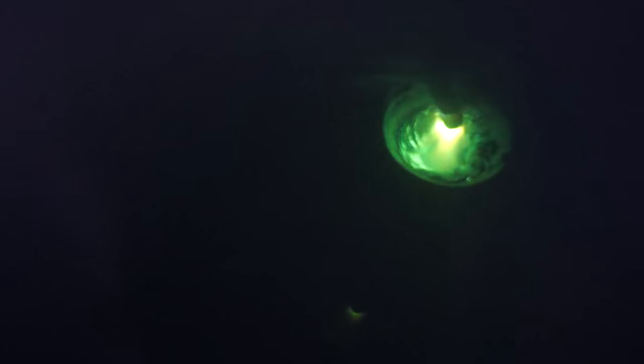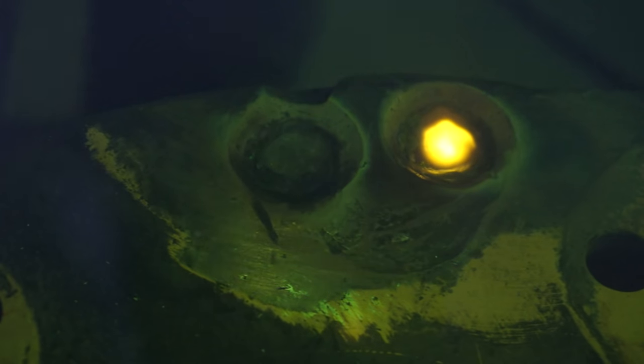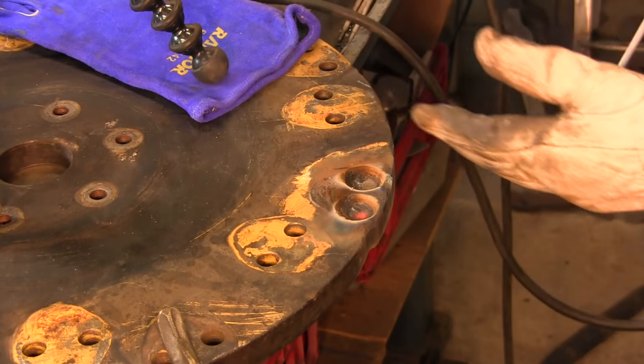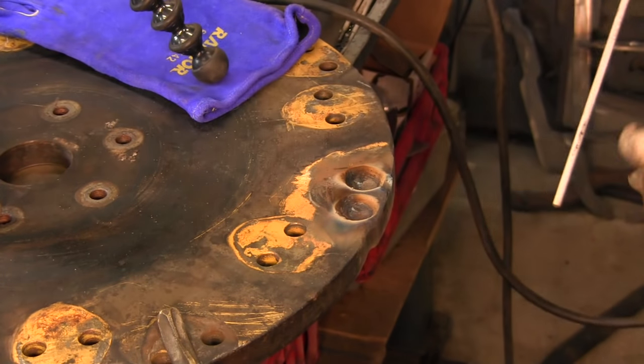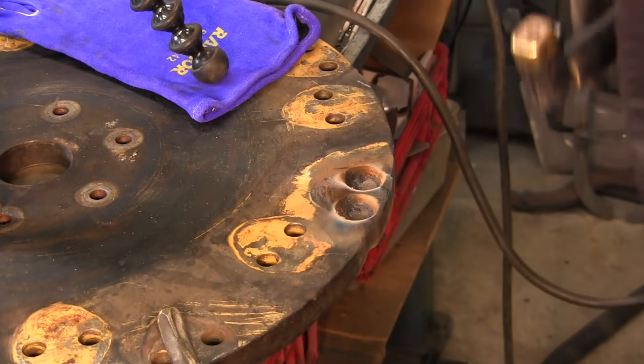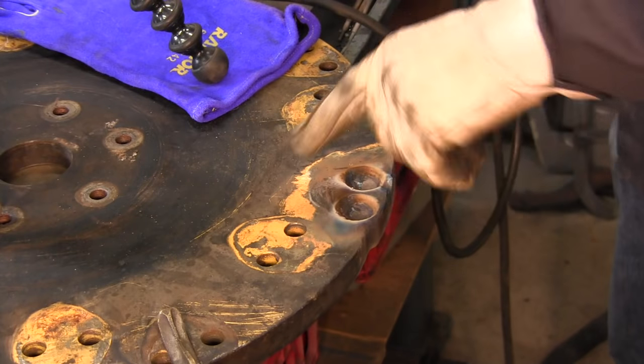Here's the other one. Just from the heat of that first one, I can already tell this is a little bit more fluid. I'm trying to hold a little closer arc, which controls the heat down a little more. You can see it struggling a little bit to close. Okay, we have those two closed up. I'm going to lift the plate up, flip it over, and attack that from the other side. I'll set this rod over here — we might use those on part of the facing pass later.